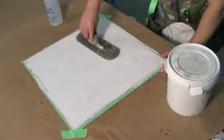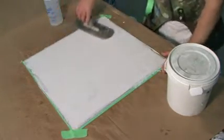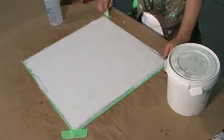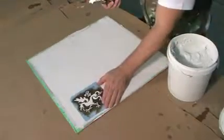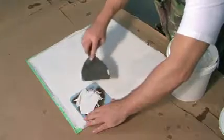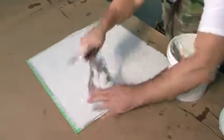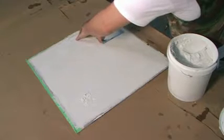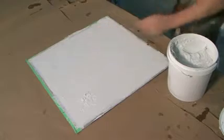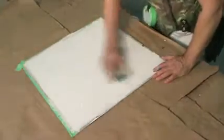Keep applying the second coat in this fashion until the whole surface has been completed. The Versi-Plast must now be allowed to fully dry. At this point, if a stencil relief application is desired, this should be done prior to the final glaze application. Allow the stencil relief application to completely dry before commencing with the glaze application. When the surface is dry, give a light sanding to remove any unwanted lines and surface nibs.